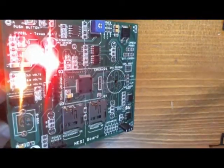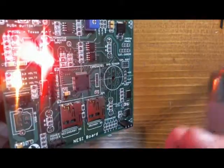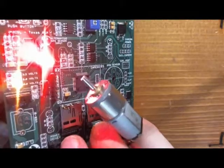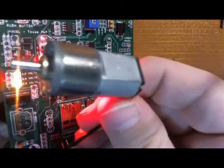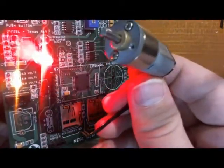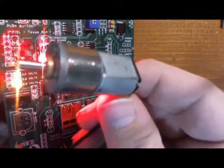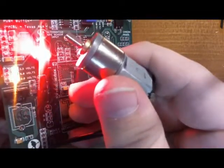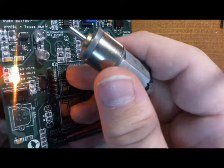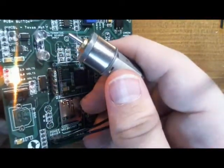And now it is done programming, and you can tell that the program is working. Well, at least part of it's working because the red LED is on. So it's detecting that power driver A is not okay because something isn't connected to it. But if we attach a motor to it, because in our program we turned the red LED off after the entire cycle is completed, as soon as I plug this in, it'll begin running, as you can see there. It's actually running, and it'll complete that cycle, and then it'll turn the red LED off. In practice, you probably would put the turning off of the red LED at the beginning of the program.